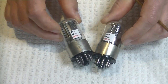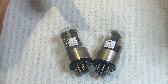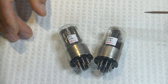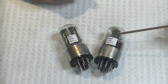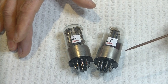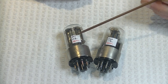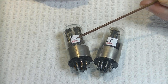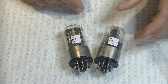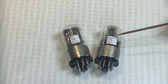These are some of my favorite tubes in existence. They're Melz tubes — M-E-L-Z, Moscow Electric Light Company. These metal-based tubes are all from the 1950s. The latest I've seen is 1961 or 62, and the earliest I've ever seen is 1951, though I'm pretty sure they go earlier than that. Now these are 6SN7s. The 6SL7 is a very similar tube — same era, same base type, and same glorious sound. But what about our numbers? 101 and 112 — so 101 is new old stock, and 112 is even better, but there's quite a difference: that's 11%, just outside of my acceptable parameters. But what if we had another tube that was arranged the same way — 100 and 112? Would that work?